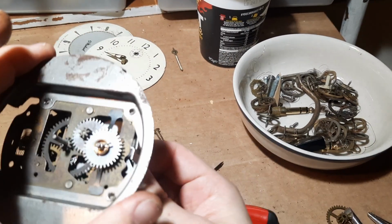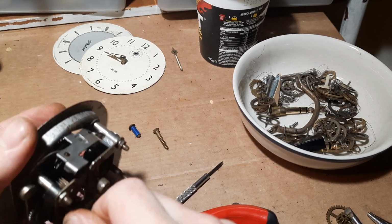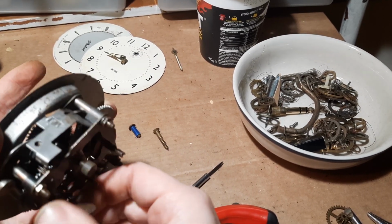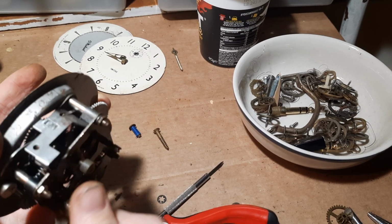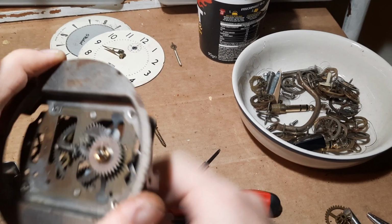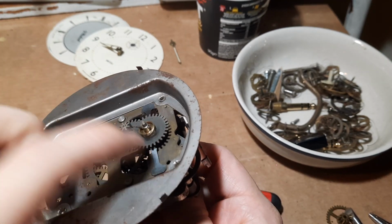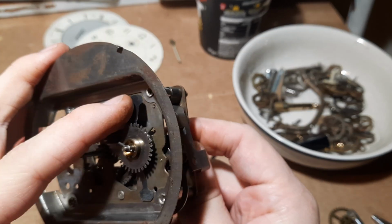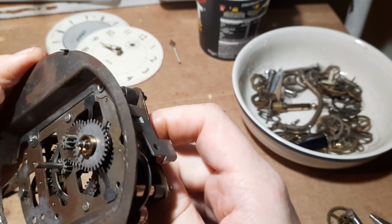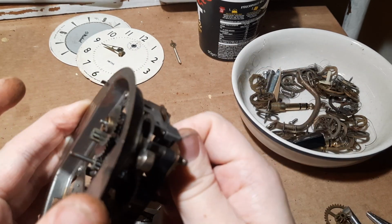Right, so if you put it around like that, so the pin's not in that little notch, and then wind it up, button should pop up like that, and you wind it. It should not ring. So wind it up all the way. When you rotate the knob and the pin falls into the notch, the wheel will pop up like that because the spring is pulling it upwards, and that will remove the spring that had the little finger on it. The finger will pop out of that rectangular hole, and behind it is the hammer, which wants to move but it can't. So when it happens, it will let the hammer move, and we should have a ringing action. Stop it with the button, that works very well.